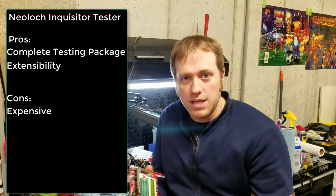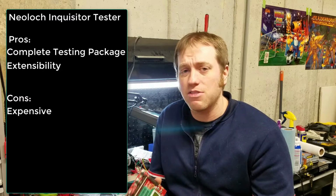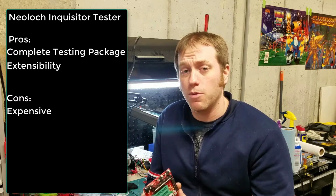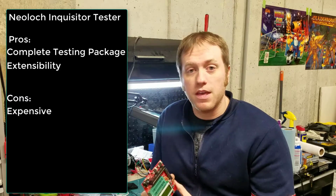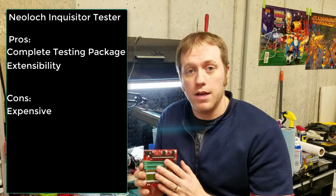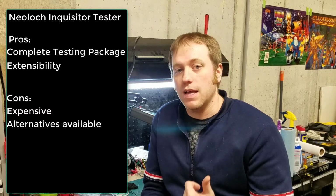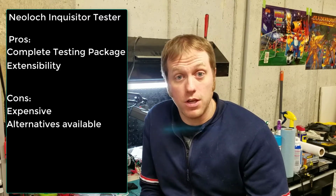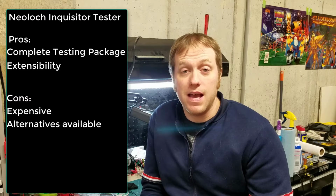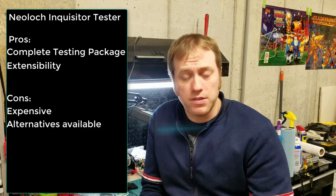I've showed some key things around Siegecraft and some of the things that they have from a diagnostics perspective. I think those are going to be much more helpful for the money than jumping to something like this. The other thing is that some of these tests that this can provide, you can find other ways to test those key pieces. So things like test ROMs, like I've showed the Leon test ROM in my System 9 and System 11 videos, where you can test the PIAs while they're in circuit. So those are other ways that you can do some tests.